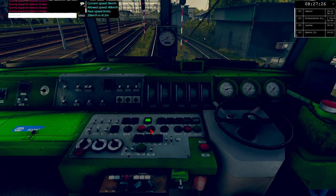Right. When we did that, we need to turn on the converter. Why is that? Well, it's because the voltage in mainline is 3000 volts, while some of our equipment is using 110 volts. That's why we need to convert some of that voltage. Wait a little bit before turning on the next equipment, which is the compressor. And the switch for it is located right next to a converter switch on button.